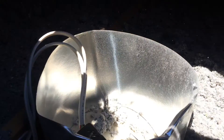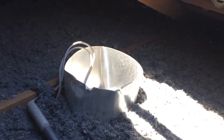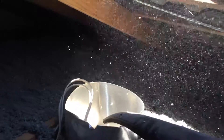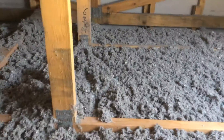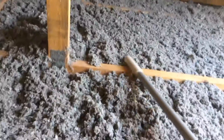I'll just come in here and show you around. That's a downlight there that we just insulated around, but I haven't cleaned that light out yet. We just get one of these battery-operated garden blowers and make sure that there's no insulation sitting around the light itself. This is inside the roof.